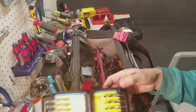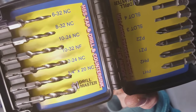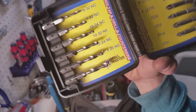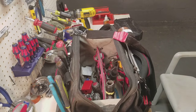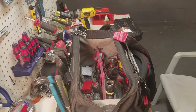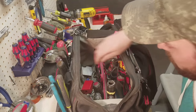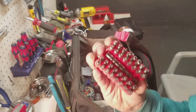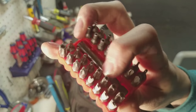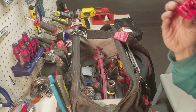Here's these — I've had these in another Harbor Freight video. These are the tapping drill bits — they're awesome: drills the hole and taps it to those sizes. They're all the sizes I use every day. It comes with some Phillips and flatheads but that's not where it's at. It's a copy of a more expensive set that's twice as expensive but not twice as good. So if you bought the Greenlee set and broke them and need a new one — Harbor Freight Drill Master, definitely a good value. Another Harbor Freight item is this security bit set. It doesn't just cover security bits — these are Torx and these are Allens, whether you have the pin in the middle or not. It's a compact little set that covers a lot of ground for how small it is.